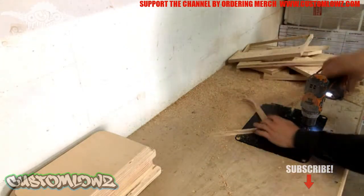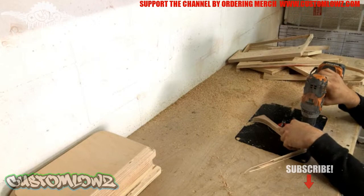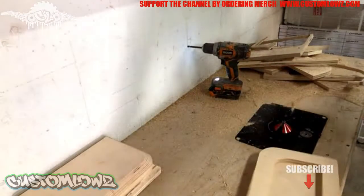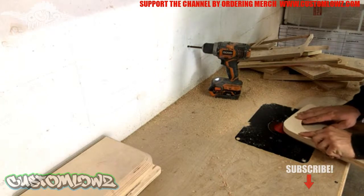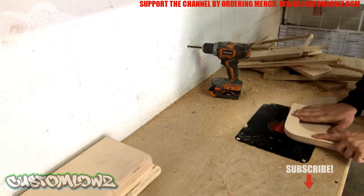Take a flat piece. I don't want to go past the limits of the router itself, so we may have to do two more passes there. Actually, this thing is such a big bit, you really want to be careful with taking out too much at one time. You definitely will do it with this damn thing. It's way big. You want to make sure you have your piece held super strong.